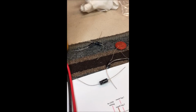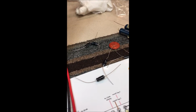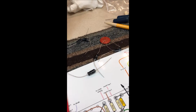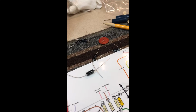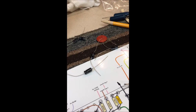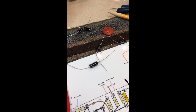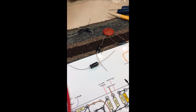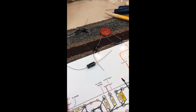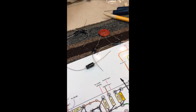One of the other things, people talk about how everything that is made electronically is made in large batches. They make a large batch of anything, and they shoot for a specific tolerance of what they're trying to create. And when the items come out of the batch, depending on how they happen to come out, that's where you'll see the rating of 1% tolerance, 5%, 10%, or 20% tolerance.